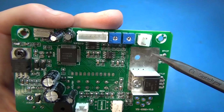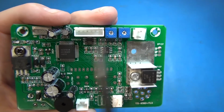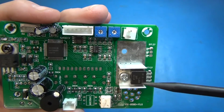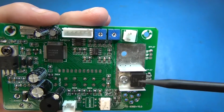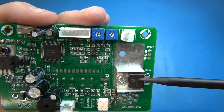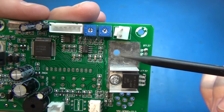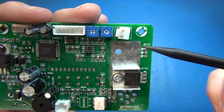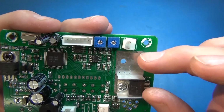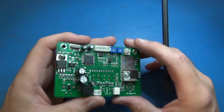Now, see, I was originally thinking that this Triac was missing because I was thinking that this micro was controlling them together. And that way, if this thing was solid on 600 volts, it could go 8 amps solid. But it can go quite a bit more amps than that if it's just pulsing. But I thought because the tip on this was capable of pulling about 9.5 amps, I was thinking maybe they were ganging this up and that may still be true. I guess I didn't really look inside the wand.